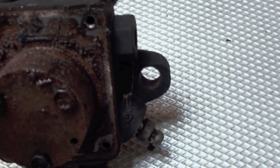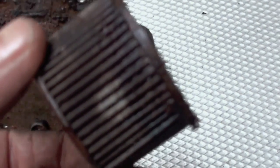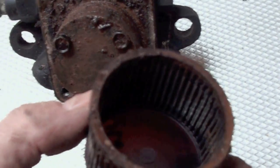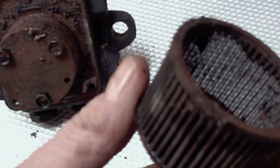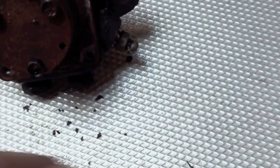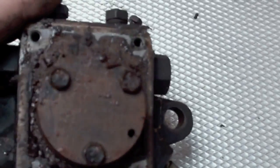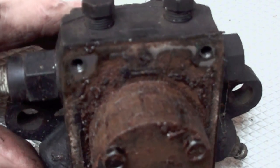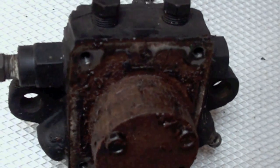This is a screen — or kind of what's left of a screen. It's still clear. Most of these pumps have some sort of screen inside them. Now here is the pump itself under here. You can see the situation — we've got just gobs of dirt and water in this thing.